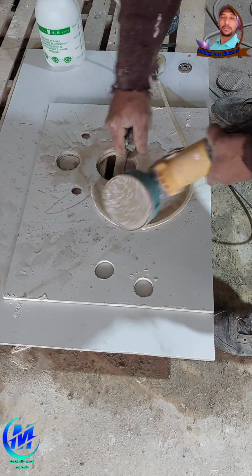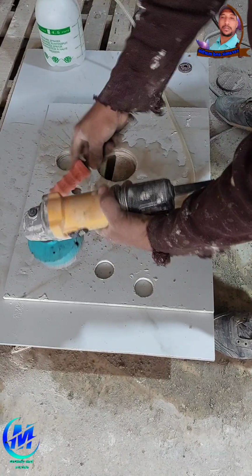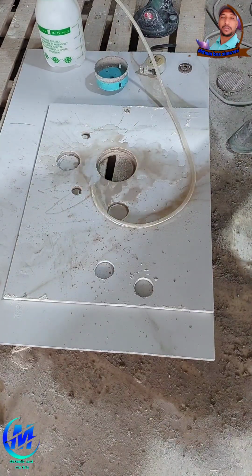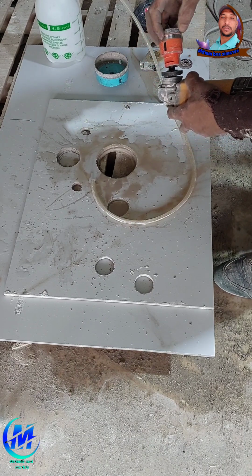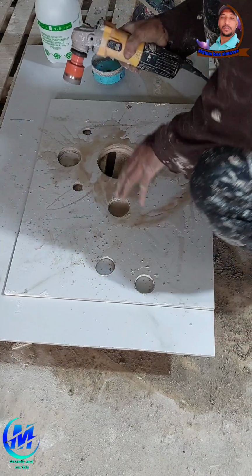Point 1. Corners and interior angles. Handle with care. Corners are tricky, especially the ones between walls or between the wall and floor. In a small bathroom, you often don't have perfect 90 degree angles, so you need precision. Use a corner square to measure the actual angle of each corner. Never assume it's perfectly square when cutting.